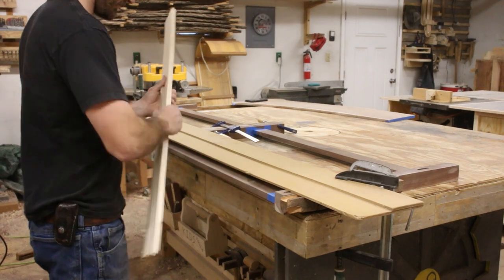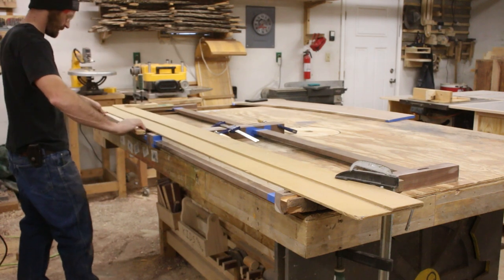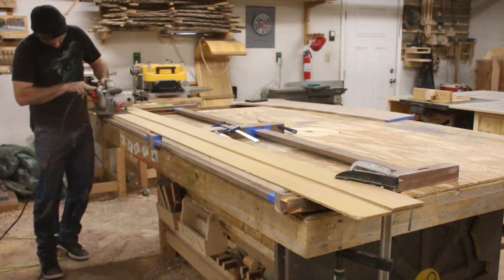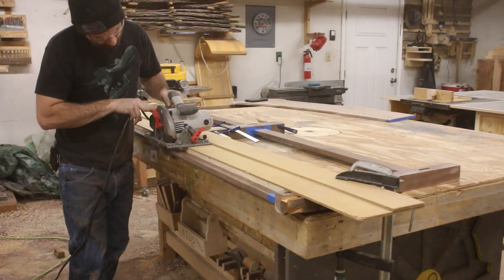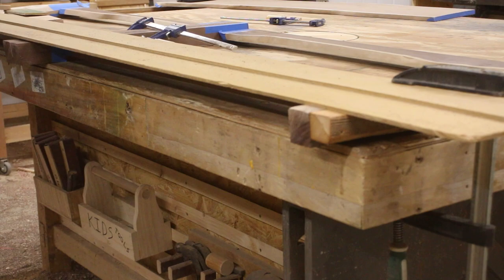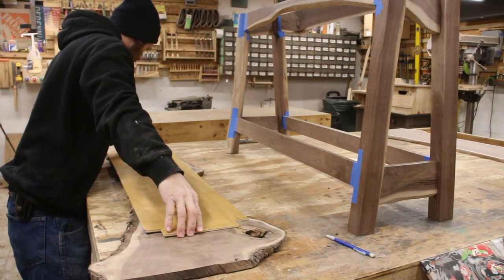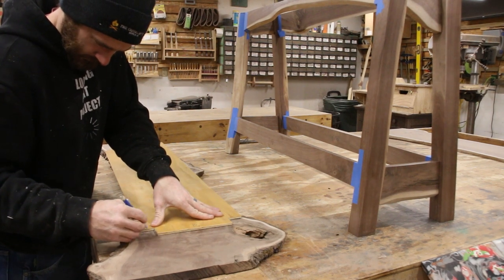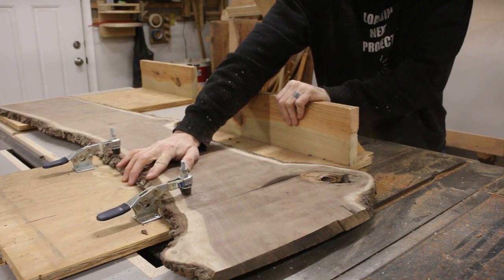Because I want this whole thing set to five degrees I have to chamfer this top edge to the same five degree angle. I'm still rocking my homemade track saw system which cuts very straight but is kind of floppy, so I had to put spacers underneath so it wouldn't fall and mess up my angle. I clamped everything together and took one long rip along the entire top surface of both panels in one pass to be sure the angle didn't change. I needed a shelf for the base and I made a template to know what shape to cut. I intentionally left a little gap so you could see one of the bottom rails — I'm going for a natural edge look and I really like the idea of seeing some of the structure of the piece, showing off the yin and yang aspect of nature and engineering.